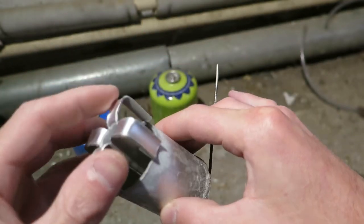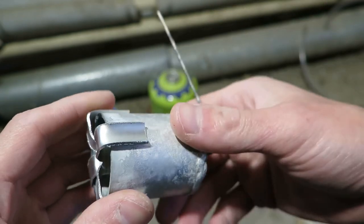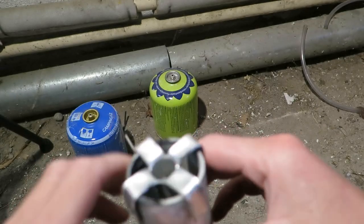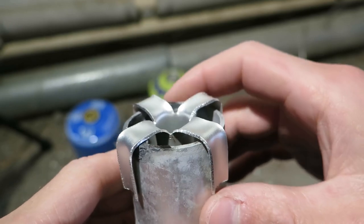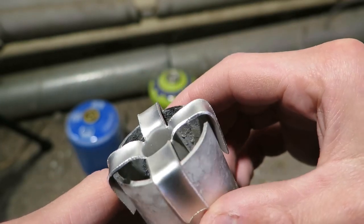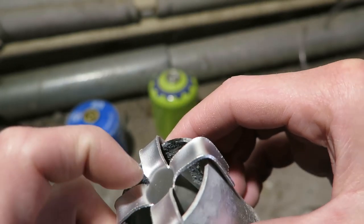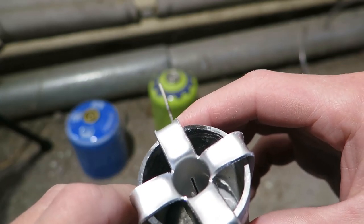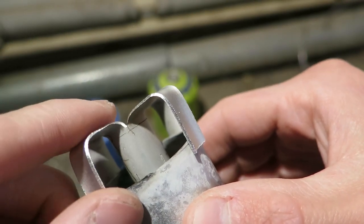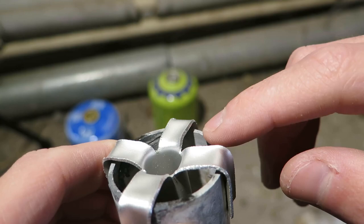It will go onto the cell like this, and my idea is that maybe this will get coated with hydroxide, so it will probably be electrically connected but it won't be a very strong connection. The next thing is that again I want to see if I can get sodium to go past something so it would basically freefall somewhere, and if that happens it would probably happen from here. I have about this much height of sodium that I can have, which should be more than enough if I fill this cell a lot.